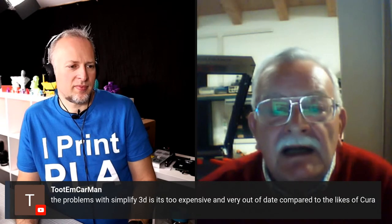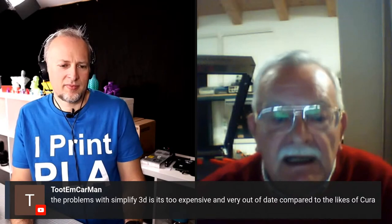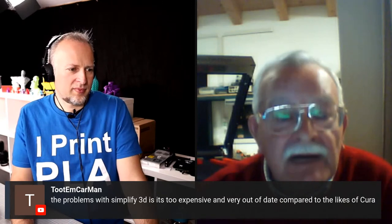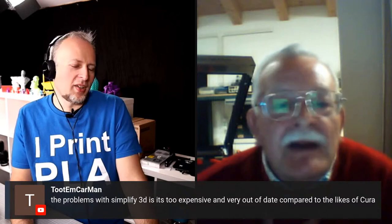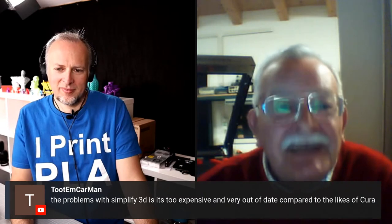There is no problem because it's possible to use. I prefer Simplify 3D with my post-processor because I am sure I can print for more than 1 week without a problem. If you look around on YouTube, you see a lot of other people that use 45 degree with Cura, Black Belt Cura, have a lot of problems for a very, very long part. This is my opinion, but every person can use every slicer. But remember that it is necessary that the slicer is able to print 45 degrees naturally.